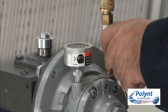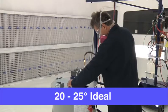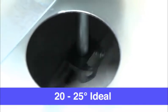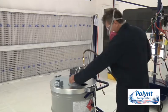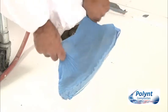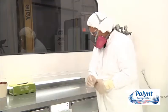Make sure the material, mould and ambient temperature are 15 degrees Celsius or greater. 20 to 25 Celsius is ideal for gel coat application. Only use materials within their recommended shelf life. Operators should also wear appropriate PPE, including protective clothing, safety glasses, gloves and a respirator.